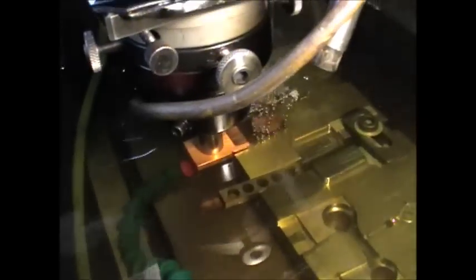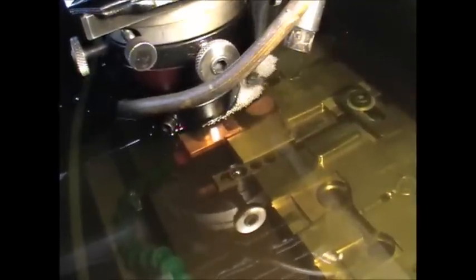That's a typical situation which allows the cutting action to breathe, for particles of soot to get out, and the process to go smoothly and automatically. In this situation you can let it run for hours — if it's a deep cavity it may run all day. The flushing may look excessive, but in this case it's just an external jet of fluid. When the electrode gets down to within the sparking depth of about 2 to 4 thou, the flow is cut off almost completely because the gap is so tiny — it's just a passive flow from outside.